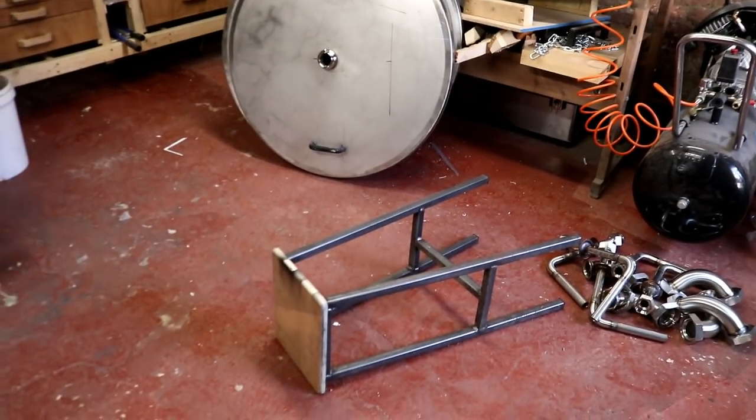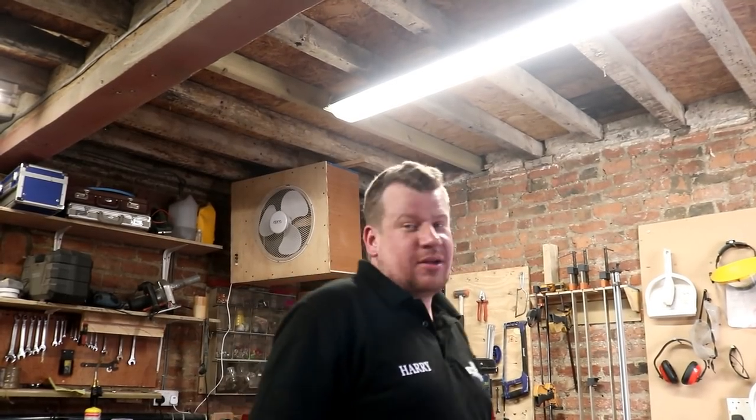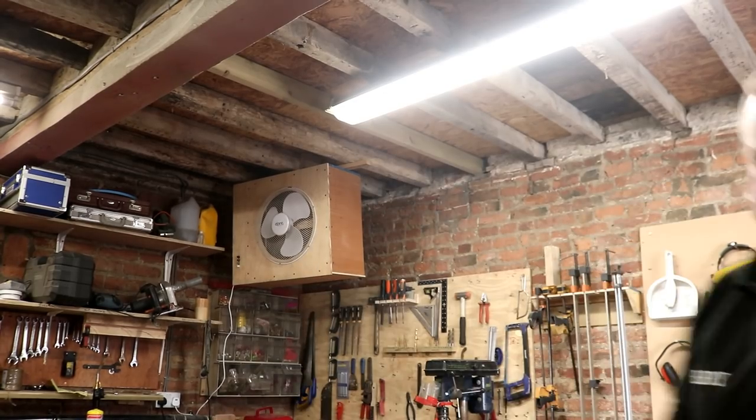It was all going well until I turned around and walked into the chair. Unbelievable. But let me just turn the gas off. Now that was an excellent run. I've got every single piece of stainless steel that I tacked up yesterday, all welded, ready for pickling. The only thing I need to do is weld the outlets on the tanks, which are 5 welds that I've got to climb in the tanks to do. Then those new tanks are ready.